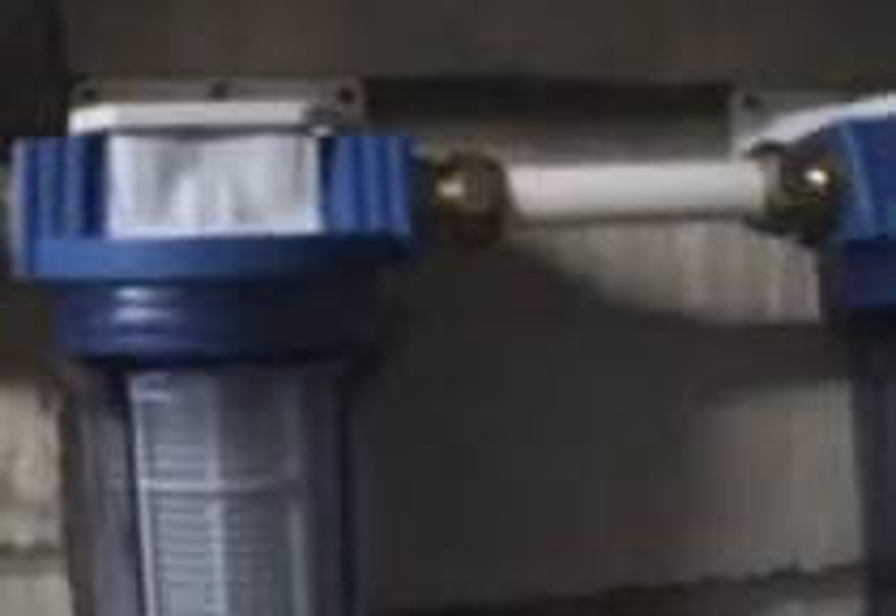So where do we go from here? We open this valve here and we can check the quality of the oil if we open this one. If we want to run it through the system, open this one and then switch the pump on. It comes down here, goes left, up here, all the way along, and then up to this filter here which is a 250 micron filter, through to this one which is 80 microns, and then the next one which is 30 microns. Then it goes down the white pipe and into the second drum.